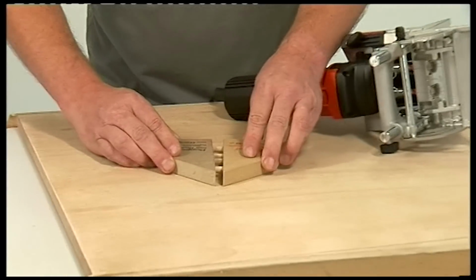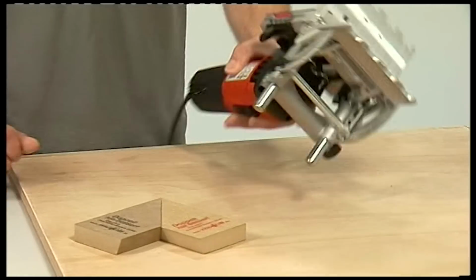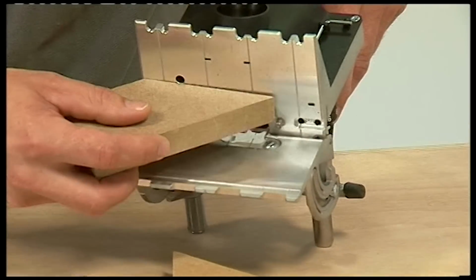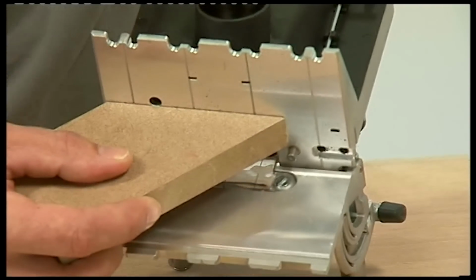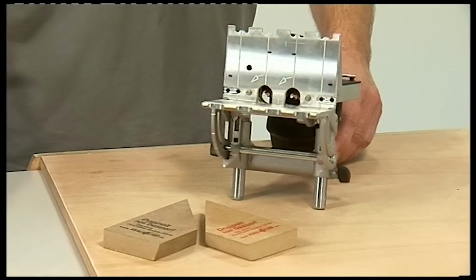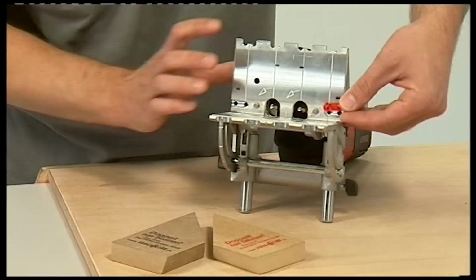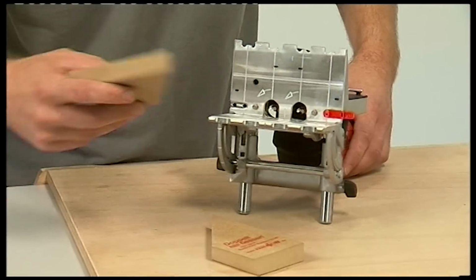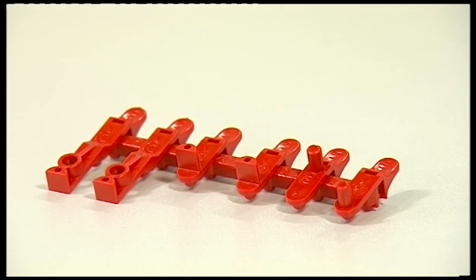The more dowels you have, the more precise you have to be. But you can see here, even with 4 dowels, everything lines up perfectly. So next, we're going to look at a 90-degree joint. In this situation, it may be that with the standard stops, the drill will actually come through the side of the workpiece near to the narrow end. To overcome this, the DD40 is supplied with additional stops to offset the holes. Using these, there is then no danger of the drill breaking through the side of the work. And there are a variety of different size stops to suit different applications.